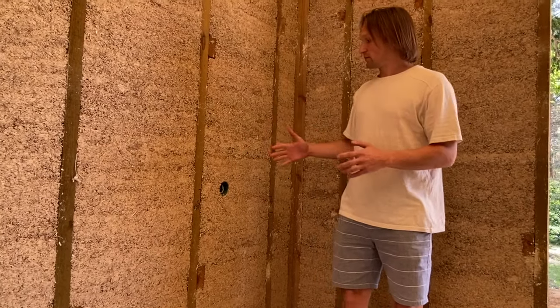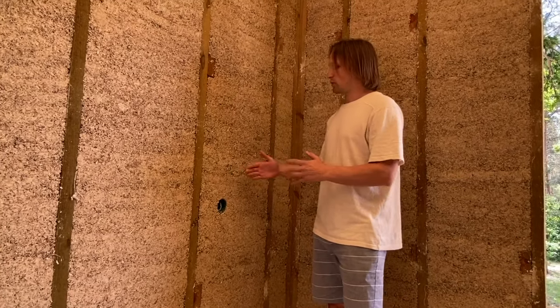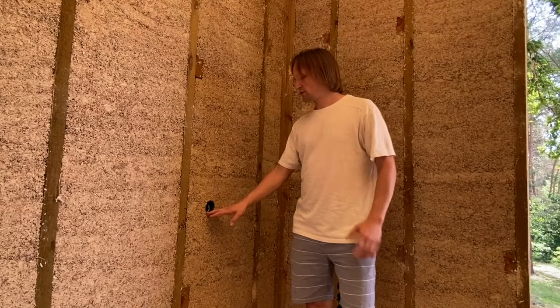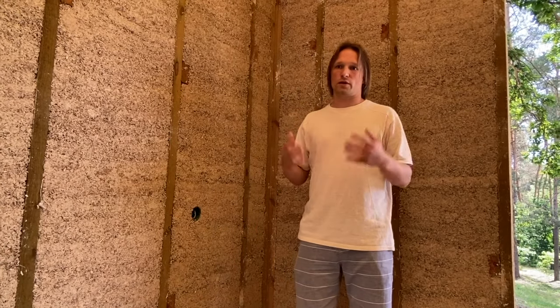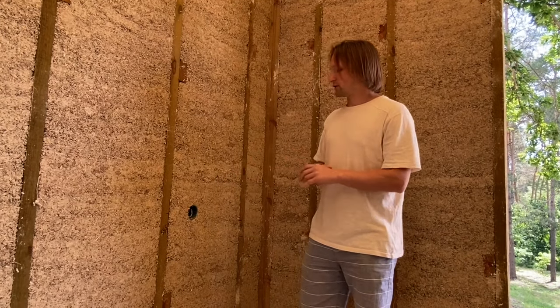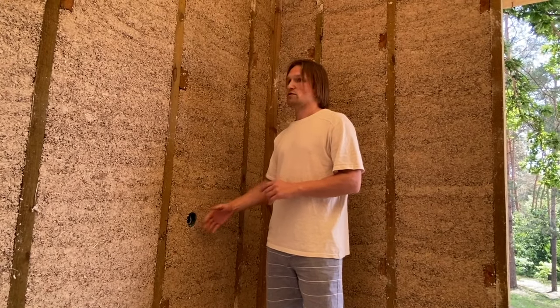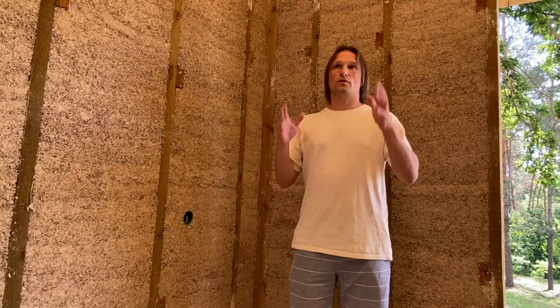The electrical cables are hidden inside the wall. Here you see a completed wall — the best approach is to have your electrical layout confirmed by the client so you know exactly where all the outlets are going to be, and you simply sink the cables in. This is the simplest way to run all your wiring before compacting the hempcrete.